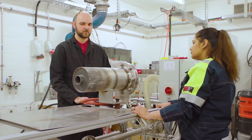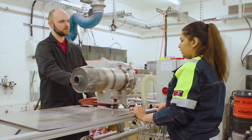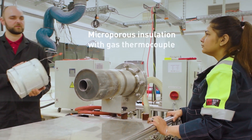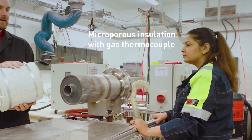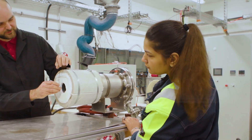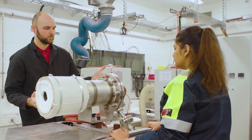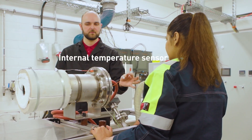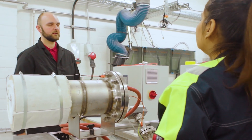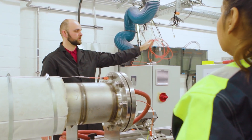And then what we want to start with is the thermal insulation. So we have prepared here a microporous insulation with a gas thermocouple which we will put in the outlet so that we know the gas temperature. We have another temperature sensor here which is the internal temperature sensor, which we will also connect to the control cabinet. So that's what we're going to do now.